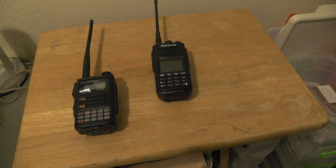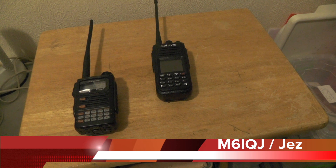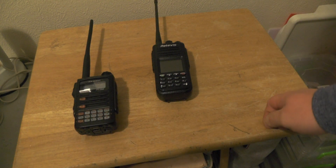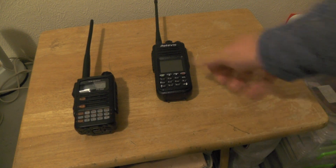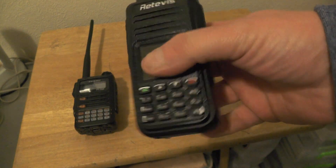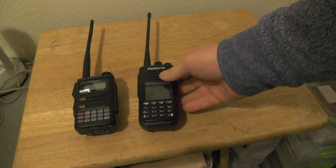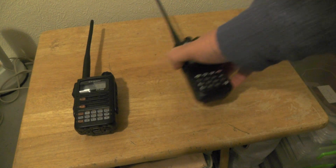Hello YouTube, welcome back to another video, this is M6IQJ. In previous videos you saw me unbox this Yaesu FT70D, and in this video I'm going to show you how to program your call sign into the radio and how to set it up for use on a fusion repeater. Unlike the RT3 or MD380 clone, you don't need to register with your ham certificate, you don't need to enter a radio ID, you don't need to put any code plugs in or any CSV files. In fact, fusion is a lot easier to get into than the other digital modes.